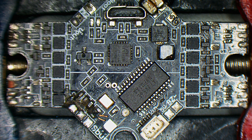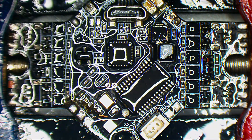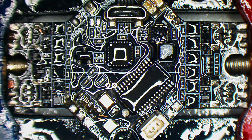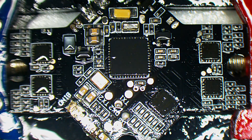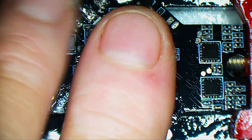I can see 130 mA of current draw. Let's spray it with some alcohol to see if something is heating up, because when I first tested this, something was heating up. So nothing on this side. Let's see if on the other side something is heating up — spray it with some alcohol and power it up. Nothing is heating up.